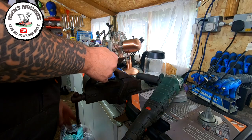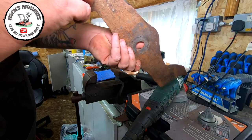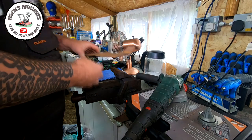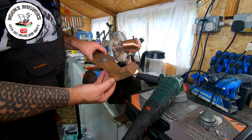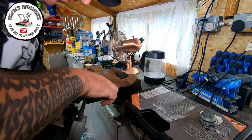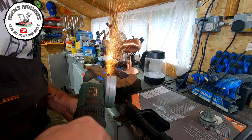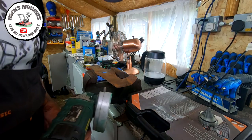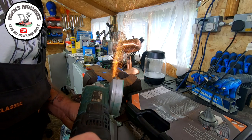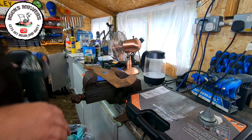With that done, I can now fully inspect the blade, checking for any nicks. There are no nicks on this blade now — I have a good edge. It's not super sharp; you won't cut your wrist on it, but it has a good uniform edge throughout. There's another nick just there, so I'm going to tighten up the blade and dull off the blade down to here — there's quite a bit to come off. Bring that down. That is now level with the low point, and by the time I put a step onto that, it will disappear.